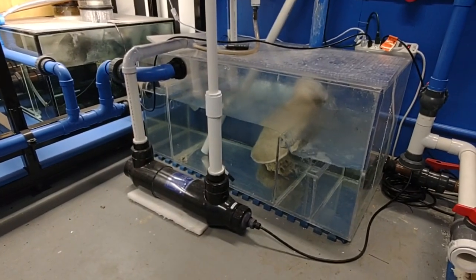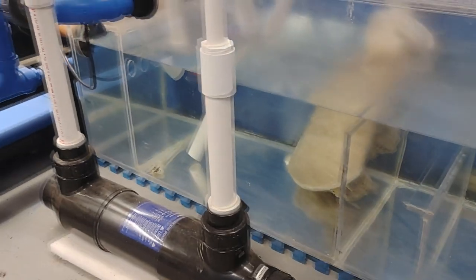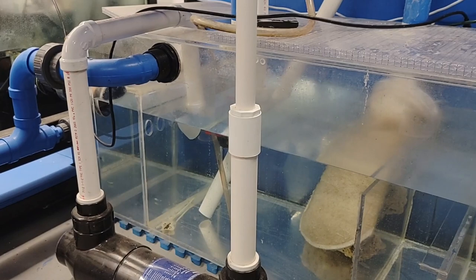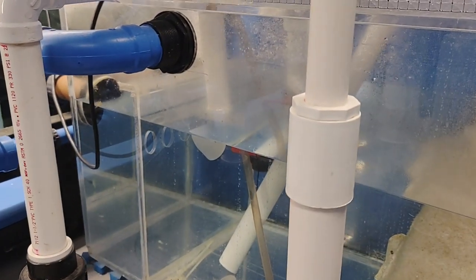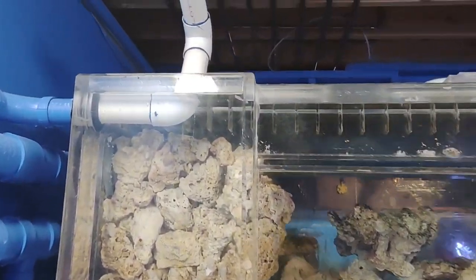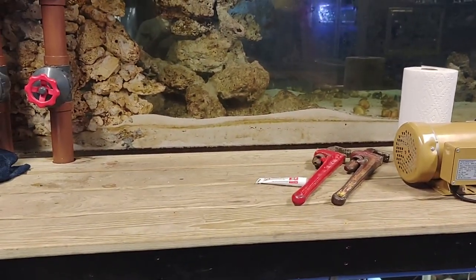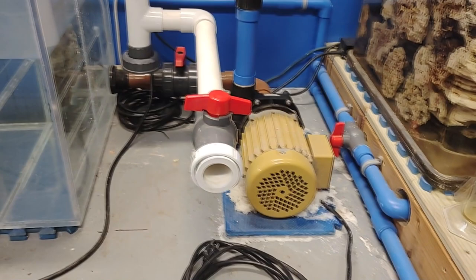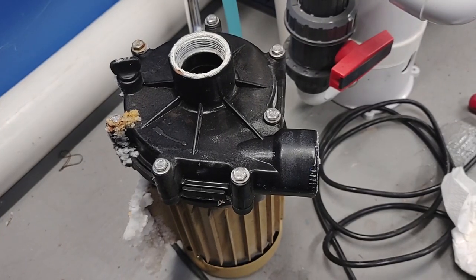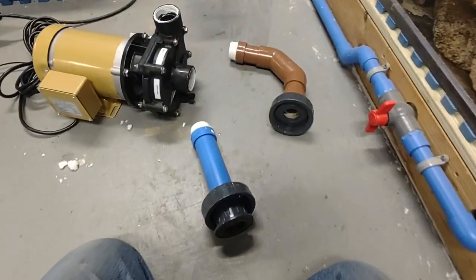The motor power is down, all valves are closed, and everything has been pumped to the top of the tank. I've got about four or five inches before water will reach the emergency overflow system. I've blocked that pipe up inside there — it's not elegant but it'll give me the hour I need. The clock's ticking — let's rip this bad boy out. The old motor is out.